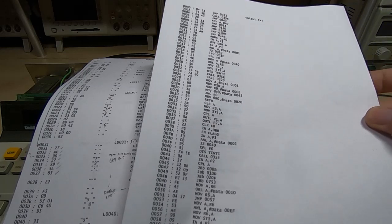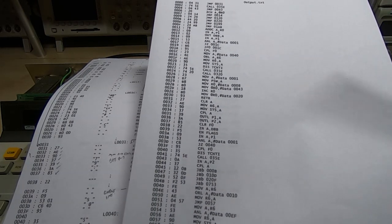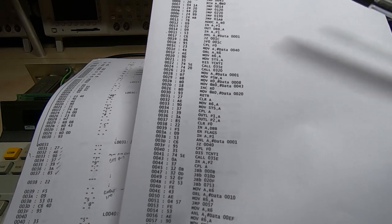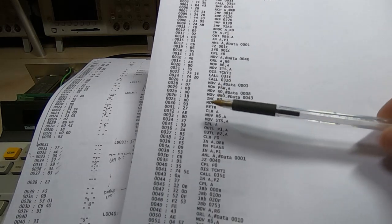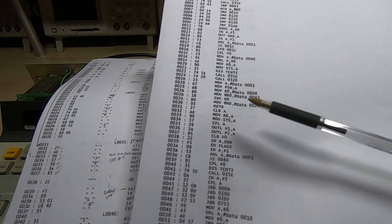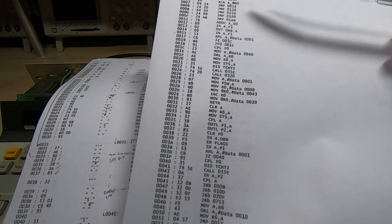I currently only have it written as a single pass disassembler, so there are no jump labels. I may do a small change to it and add multi-pass so it can create labels as to where it's going to jump to. You can't do it going just through a single pass, because if the jump is backwards, then you've already missed the opportunity to put your label in place.